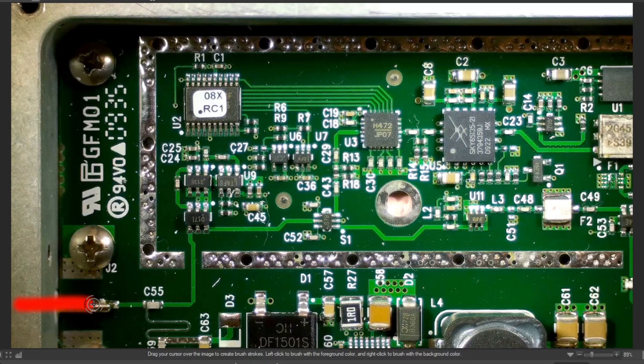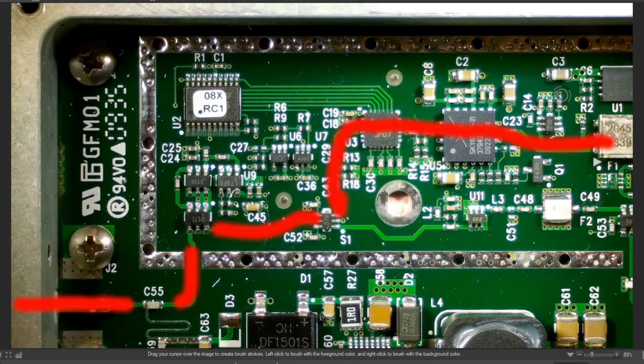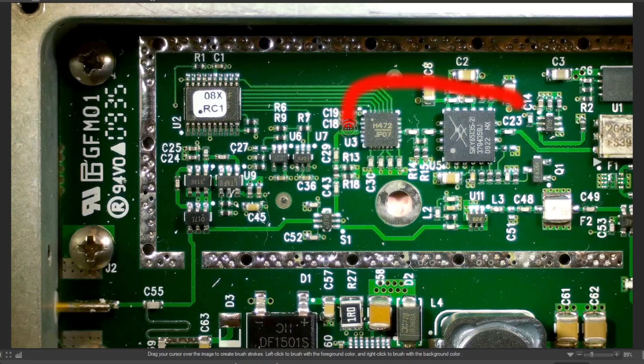The radio hooks up here. There's an inductor here for biasing if needed. A capacitor comes into the circuit. I believe this thing right here is a switch, so we can either go this way or that way. There's definitely a path that goes this way. It can either go straight through another switch and then go out, or if it goes up, it comes into this thing, then this thing, then this thing and then out. I think the receive path is the low one and the transmit path is the high one. I believe this is the amplifier here, and this might be a switched attenuator.